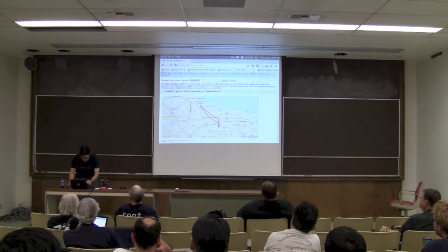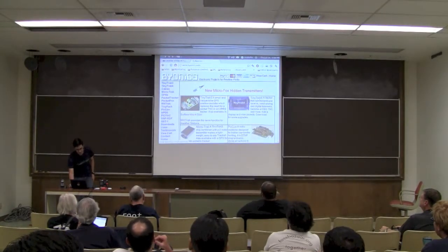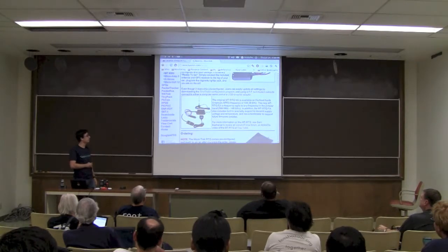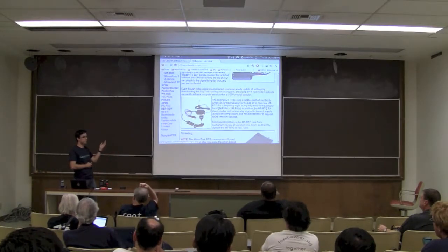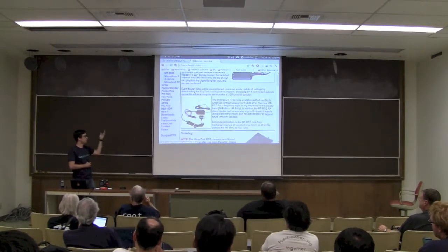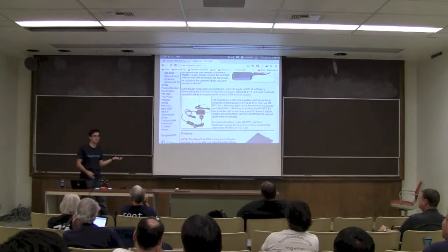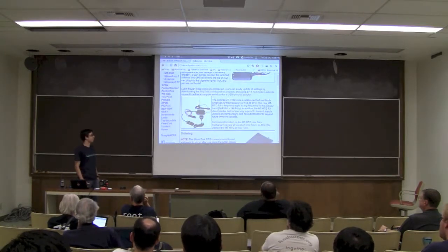So there are other devices. Maybe I should bring up that website. Byonics is a company that sells some neat little kits you can buy. This one here, MicroTrak RTG, ready to go. So it comes with everything you need to set up an APRS position recording system in your car. I wouldn't say embedded. It's some PIC-based device, and it has a built-in radio, and you connect it to this GPS and plug it in a cigarette lighter, and you're sending packets to the internet, and you're not paying for a data plan on your phone to use Google Latitude. I guess that's the only reason I could give for not using Google Latitude and using this instead. But I guess mostly people do this because it's hardware hacking or they find it interesting. Why do I find it interesting? No reason.